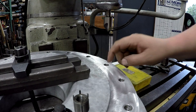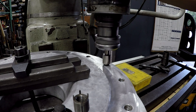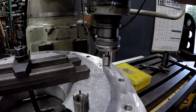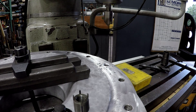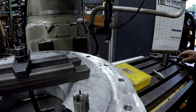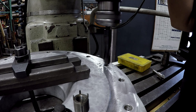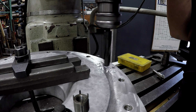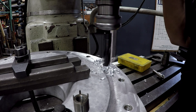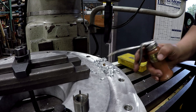I'm going to start with a chamfering tool. I like to chamfer it and center it up first. Then we're going to go in with our 53/64 drill bit — nice and clean. A little drop of oil there.